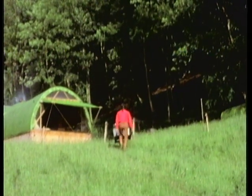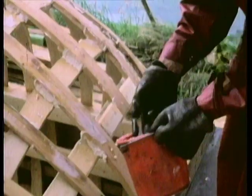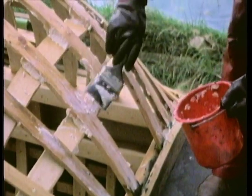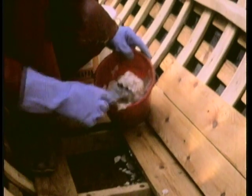Use wood like ash and pine that would otherwise be susceptible to rot. We're pasting this mayonnaise-like material over the wood, as you saw early on, and in a period of about 2 weeks, it soaks right through the wood, preserving it all. We applied it generously over the keelsons. Over the 10 years that we had the boat, we never had any rot anywhere.